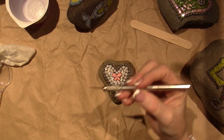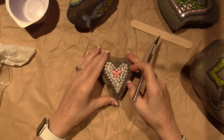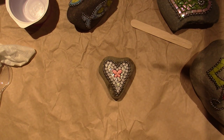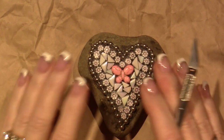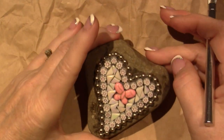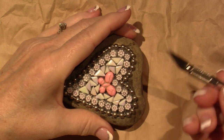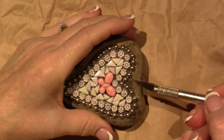The first thing I want to do before I grout these is make sure that any residue or silicone that got on the rock, anywhere I don't want it, is removed. I can see the shine here — that's telling me there could be some silicone on the rock — so I'm just taking an old exacto blade and scraping it a little.